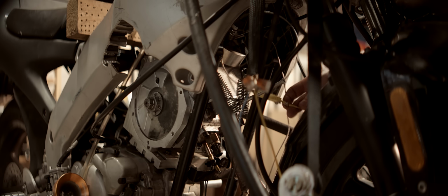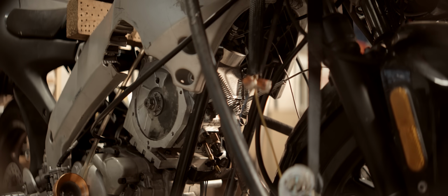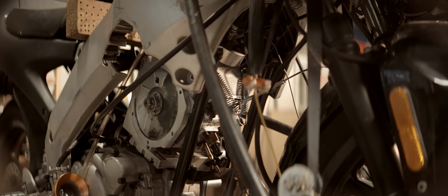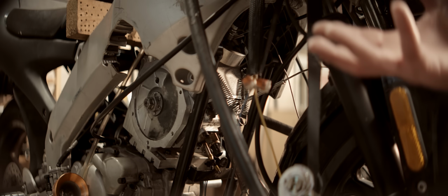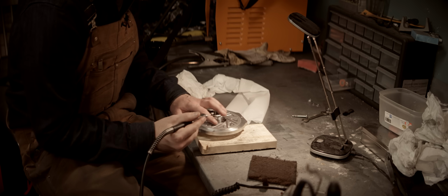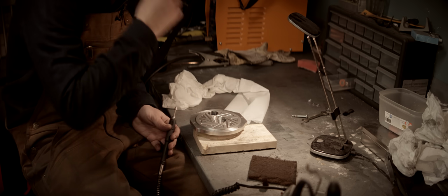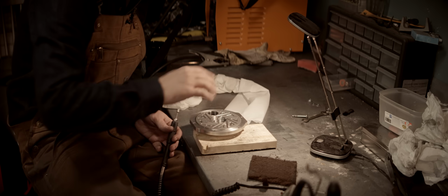I've hooked up the EGT probe. So now we can log the temperature of the exhaust gases and see if they're really low. If they are, then there's definitely some short-circuiting, or at least really bad mixing of gases in the cylinder, in the combustion chamber. I'm further softening all the edges here just to be absolutely sure there's no sharp edges which that valve can catch.